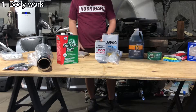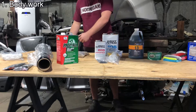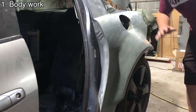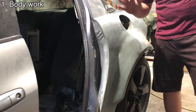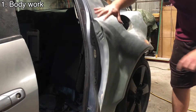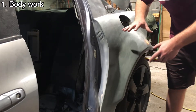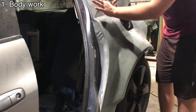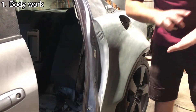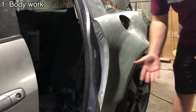For the quarter panel, I'm going to be laying over it and not creating a mold and then laying inside the mold. What I mean by a plug and a mold — this would be called the plug. If you wanted to do a vacuum bag and make the exact same part out of carbon fiber, you would lay fiberglass over this using a couple of different methods, PVA, and create a mold, which would be the opposite side of the object. When you pull it off, you'll have this object on the inside, and then you take carbon fiber, put it inside that, and create your carbon fiber part.